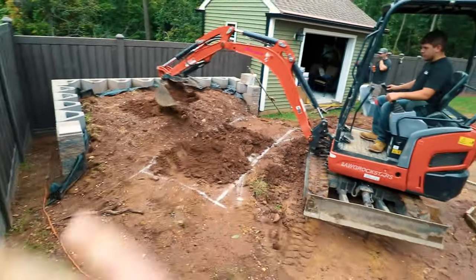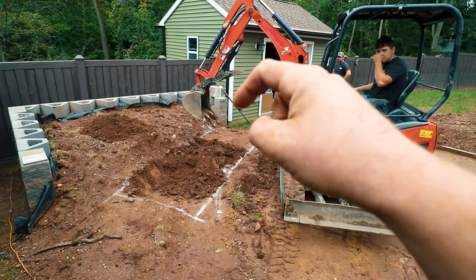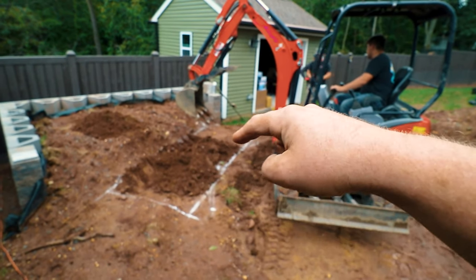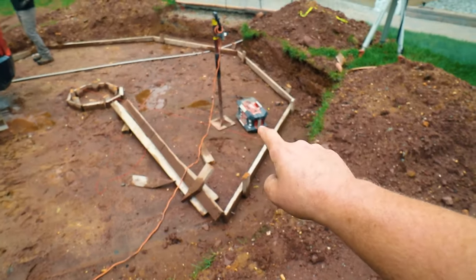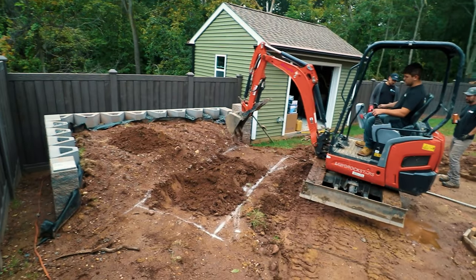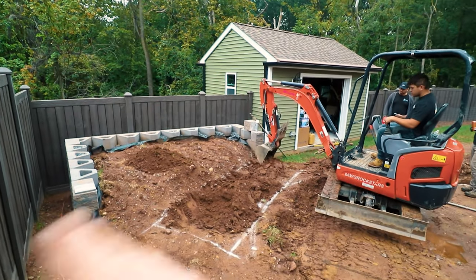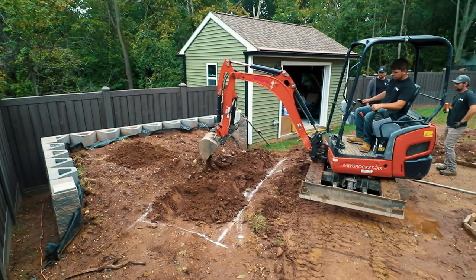When installing a pondless waterfall, the basin or holding tank for the water that gets recirculated sits within an excavated area. We've outlined the space needed for a total of eight small aqua blocks, laying them lengthwise end to end with a second row next to it and the pump vault located at the far side. The contractor gave us the finished height, so we know exactly how deep to dig to get the top of our blocks sitting about four inches below finished grade. Our excess soil will be bermed up into this retaining area so we can carve it out into multiple cascades, streams, and little curving areas to have all that water drop back into the basin and recirculate through the system.